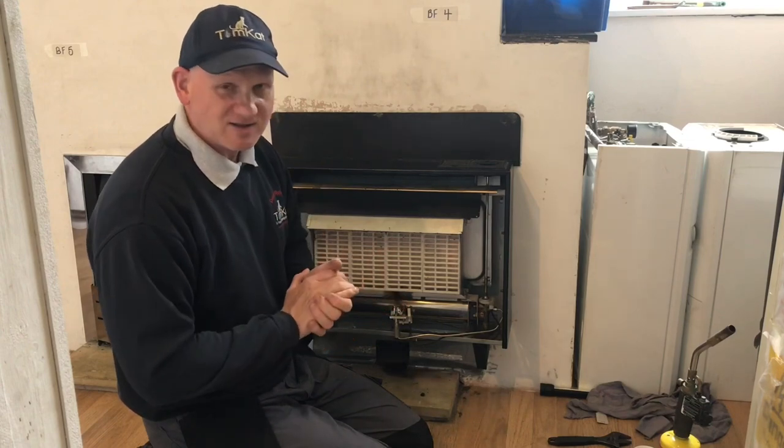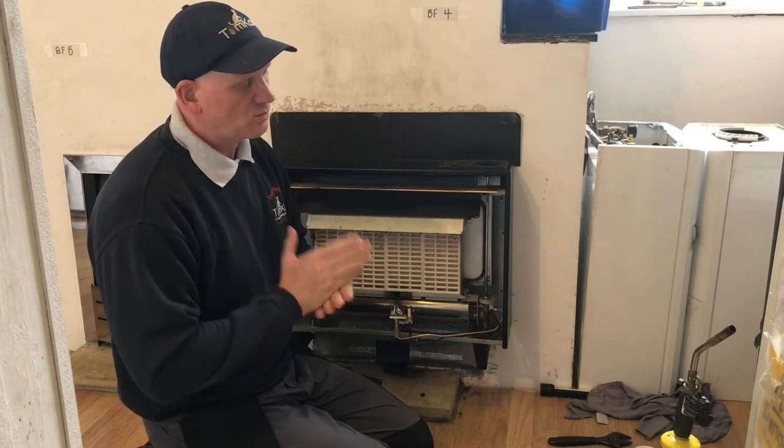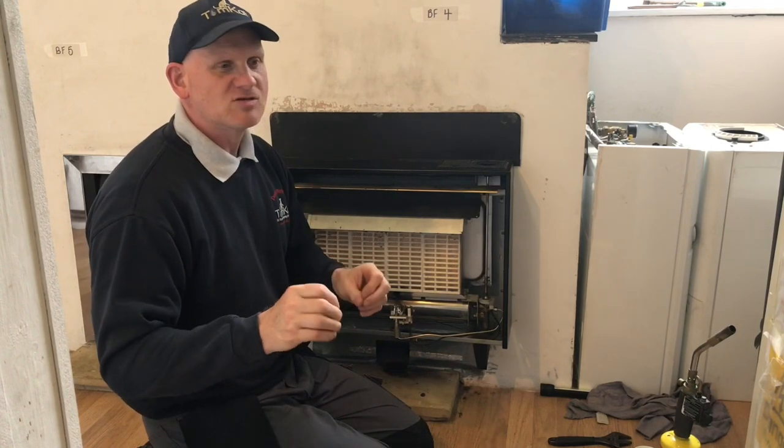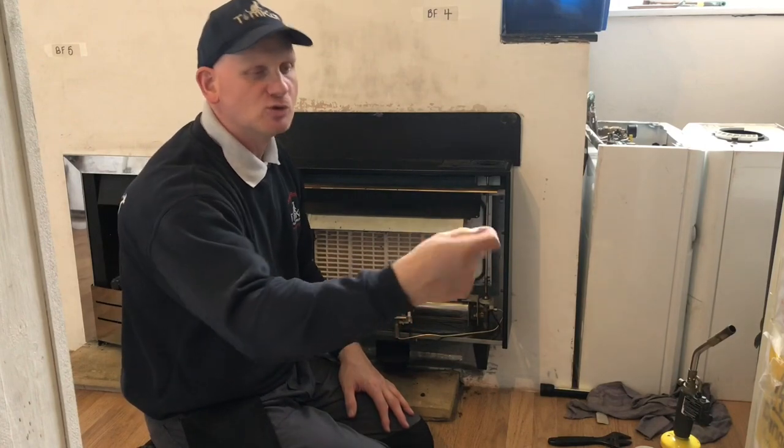If it passes its spillage test, to where the manufacturer's instructions tell you to, and there are any fans in that room, then you need to now operate the fans. If there are any passive stacks, we now need to close them. Also, if there are any fans in an adjacent room, we need to operate them. Adjacent room means you're only going through one door to get to that room. You're not going through two doors.